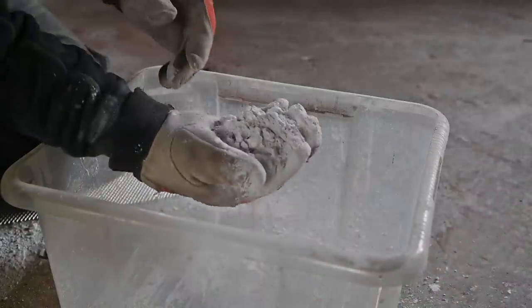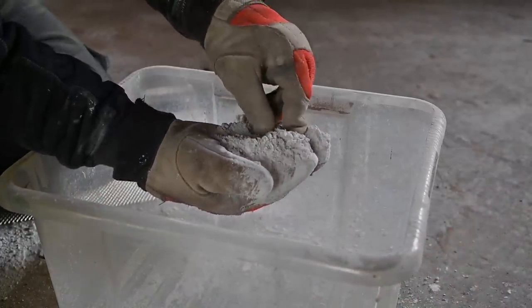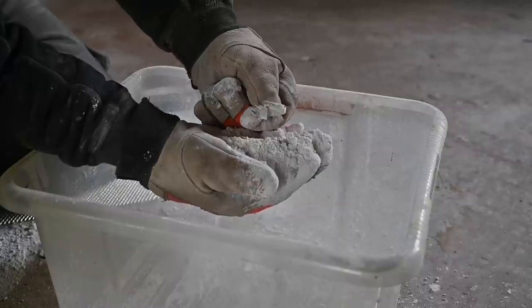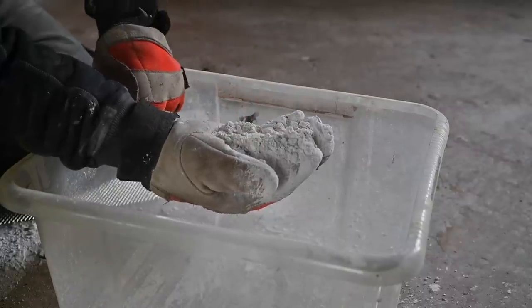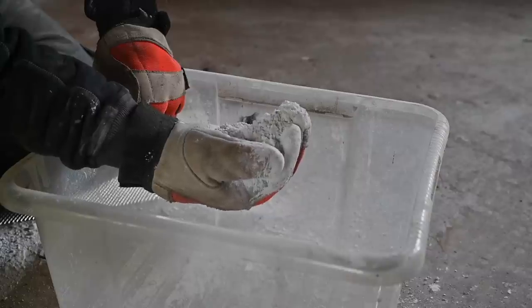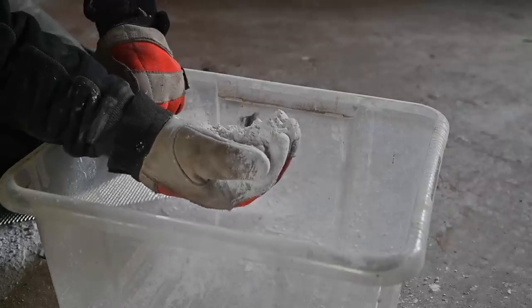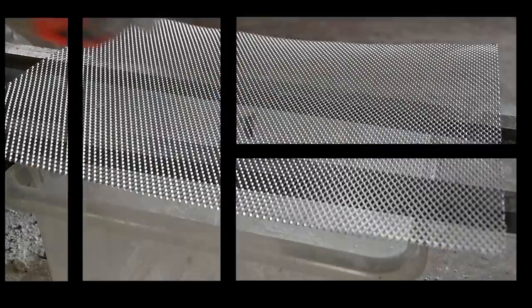The problem with chalk is that it tends to absorb humidity from the air, and then you get these hard pieces inside, but you can crush them very easily. So you can't use these hard pieces in your bastard mortar. So I typically sift it. So let me show you what I do with this. So you don't need to throw these bags away. There's no need for that.